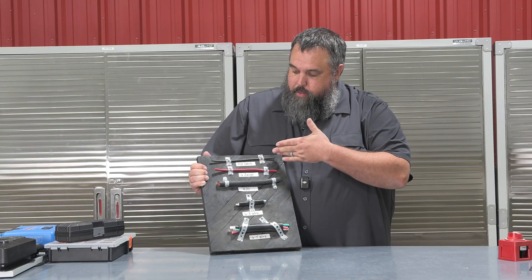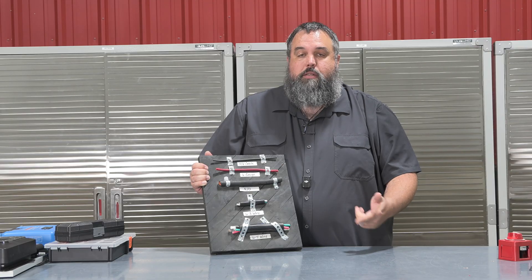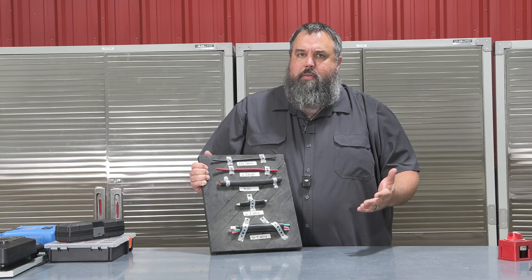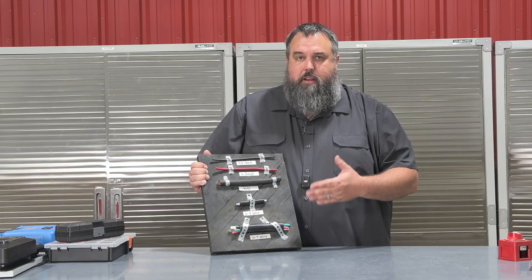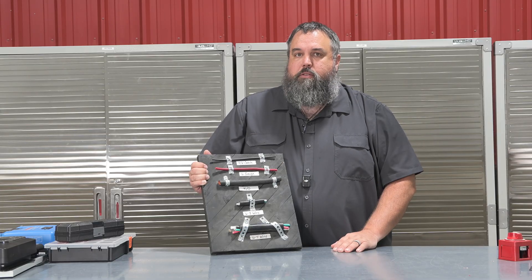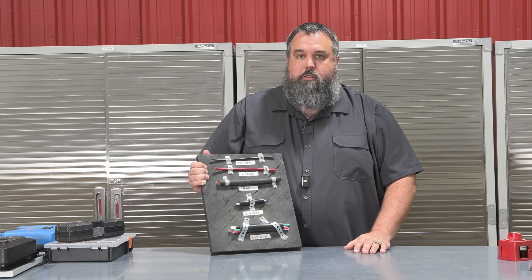I never want to put this little wire — which we call PV wire, and it only comes in two sizes, 10 and 12 gauge — on a 50-amp circuit. That PV wire handles right around the 20 to 30 amp mark, depending on which size you get. We always want to make sure our wire can handle the amperage running through it, because if not, that's where we can get into some big trouble.